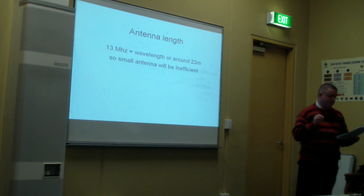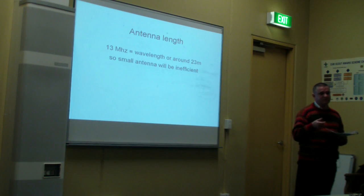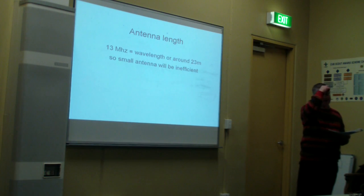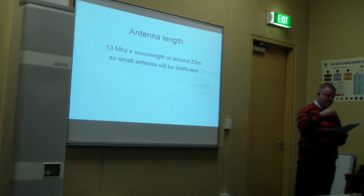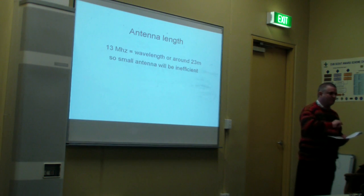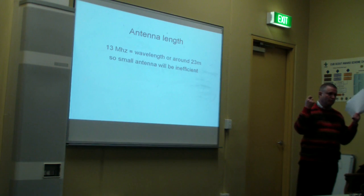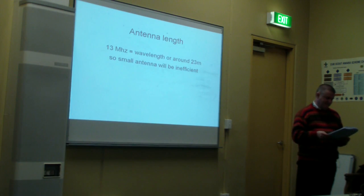The third reason relates to the mode used. RTTY is a good digital mode for long-distance transmission of data, but if you have a very small number of characters to send, the gold standard is WSPR, which was a very recent digital transmission medium put together by, I forget the guy's name, but he's a physics professor. Joe Taylor. So Joe Taylor, is it? Joe Taylor. Thanks for that. Yeah, Joe, K1JT. And even with a comparatively small amount of power, because of the digital techniques used at the reception end, you can dig the signal right out of the noise. And so 10 milliwatts will get you hundreds of miles. It's really a very impressive thing.